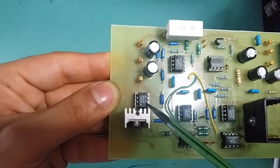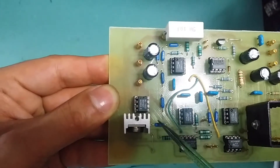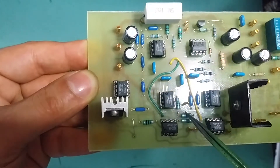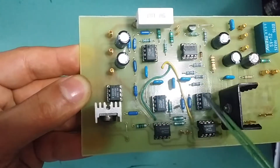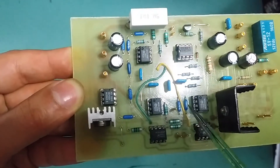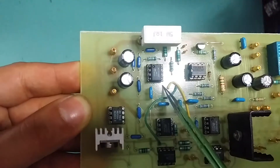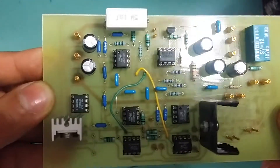This section of the power supply is the voltage reference — it's got its own voltage regulator. I've got my voltage reference, the REF01, going through a precision resistor divider to give me 5 volts instead of 10 volts. That fits into an op-amp to get buffered, then goes into a potentiometer, then into another buffer, and then goes to my voltage set. I've got the same thing for the current: the 5 volt goes into another voltage divider and gets down to 1.6 volt.